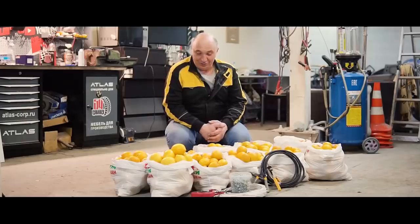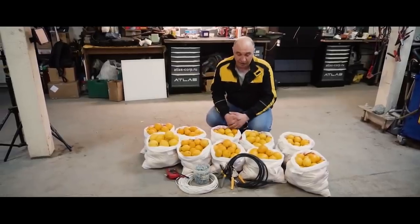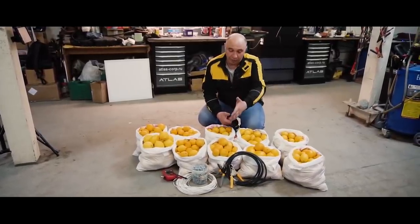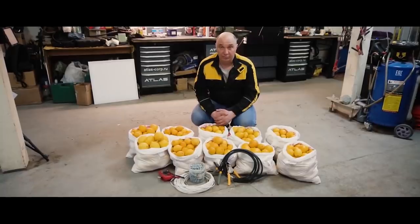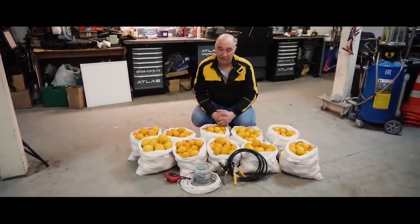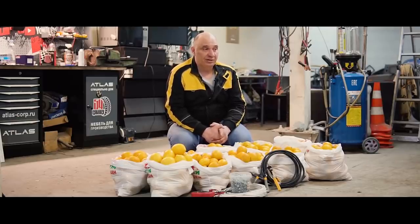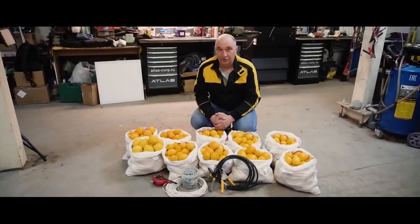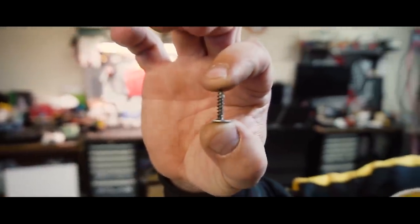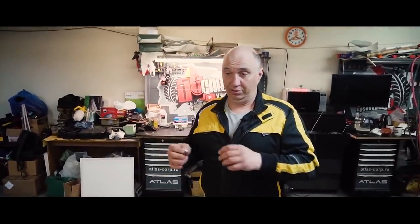So we've made a trip to the grocery store to buy some citruses — vitamin C after all. We're looking at about 70 kilos of lemons. We've also got this thick gauge wire, which we'll use for a positive and negative lead, some thin wire to get everything connected, and some copper wiring which we'll be sticking into the lemons. As for the zinc, the self-tappers are going to cover that one. We're going to have to do this as quickly as possible, given that the first lemon we experimented with — we left it to sit for a bit, and after about 30 to 40 minutes the voltage started plummeting. Zinc tends to oxidize very rapidly; it goes from shiny to really dark, which is probably why things bog down, leading to a drop in voltage. We wouldn't want the voltage to tumble while we're putting everything together, which is why we have to act fast!